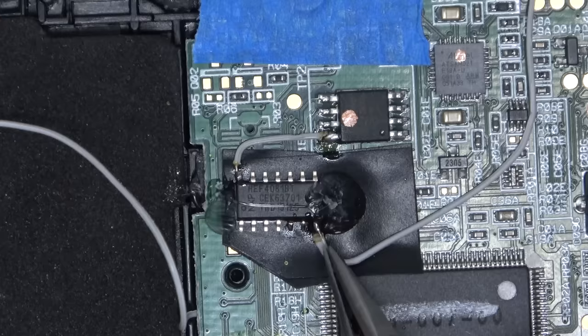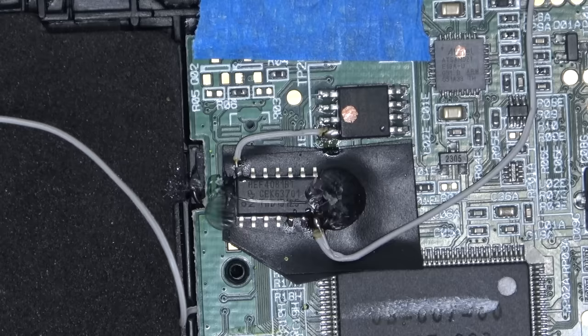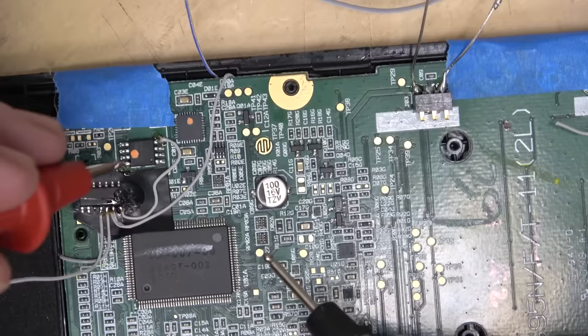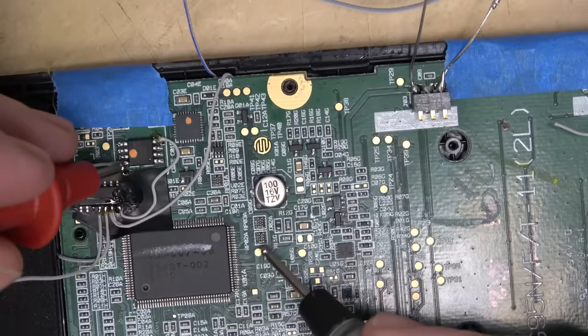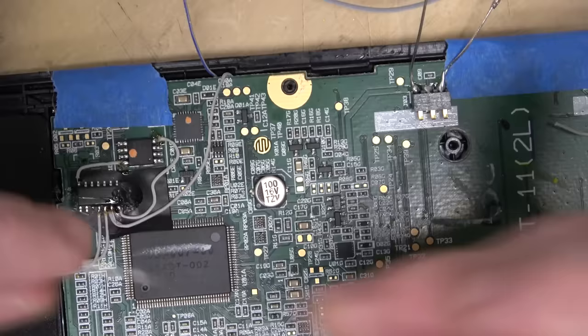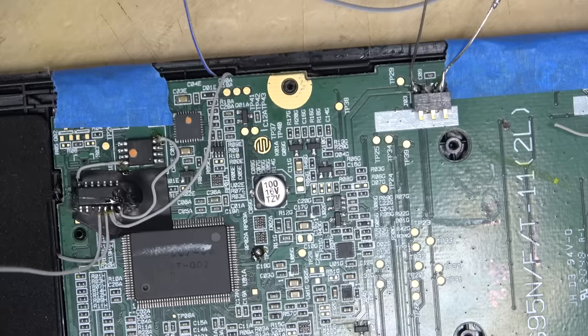The output of the AND gate is going to go to the ARM chip. Then one of the inputs is going to be from the main CPU, and the other one is either going to be from 3.3 volts or the FTDI cable. Oh crap, I hooked up the output to the ground pin. I did not heed the words of Master Splinter on that one. The test points aren't labeled, but at least they're there. Let's do a sanity check. I'm going to attach this wire to 3.3 volts, and that should restore the functions. If that works, we can proceed with attaching our other ports, or whatever it is we're going to do.